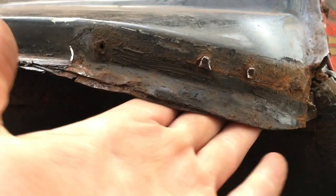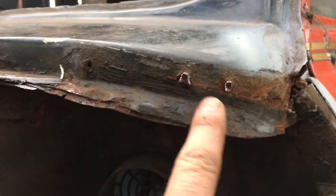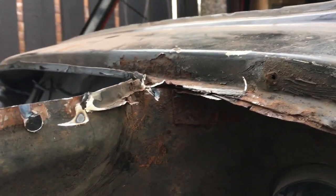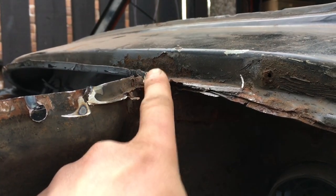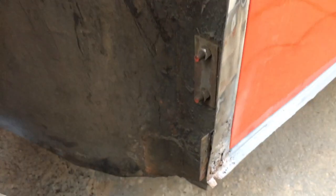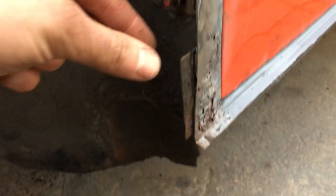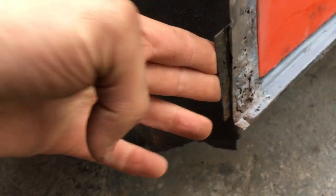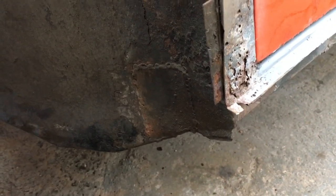This side, I'm absolutely amazed that it is completely solid. Obviously there, the spot welds from the wing had, so just clean all that back. Got to make a little piece for that, which always is part of this piece. So yeah, loads of cleaning up to do now. And again, the A panel's taken off there. You can see here as well, that's a repair that was just tacked to the inside of the rust. So wonderful, but that's part of the A panel, so that's going.